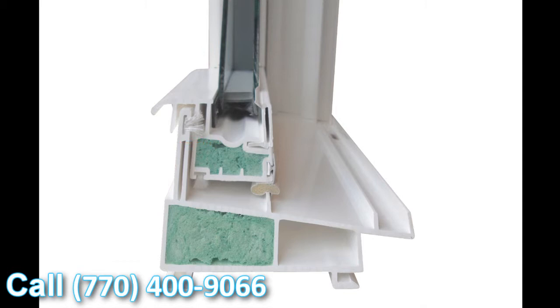The next feature is this straddle gasket. When the window is engaged and locked, you can see this Qlon weather stripping goes over the top of this upturned leg and creates what we call a straddle gasket. So when the window is locked and air or water is trying to get inside your house, it has to go underneath the straddle gasket, over the upturned leg, towards the inside of the window, and then it hits our structural interlock featured on the lift rail. So it also has to go underneath the weather stripping there, underneath the structural interlock, over the inside dam of the window, and then towards the inside of the house.